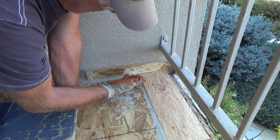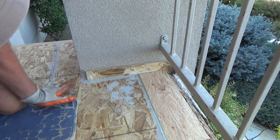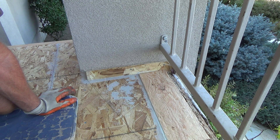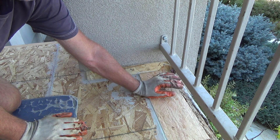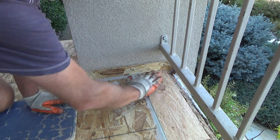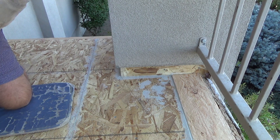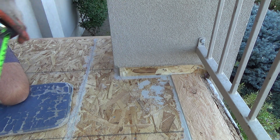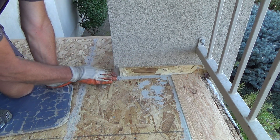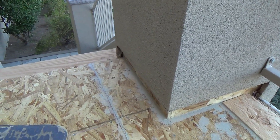That's a very good thing — I took out the flashing here and I chiseled this down, because had I not done that I would have had a hard time fitting my tile in there. I had to chisel that off, and then you have the two pieces of flashing, so that bumps things up just a little bit, and then I float down. I'm glad I chiseled that. I've got two and five-eighths so I'm tapering down to nothing — two and five-eighths is fine.